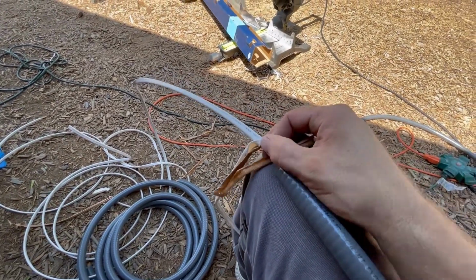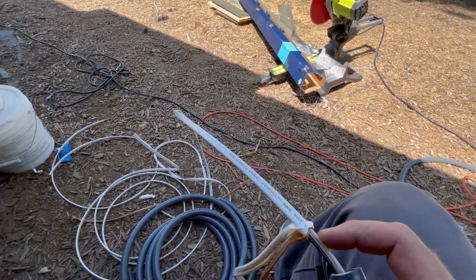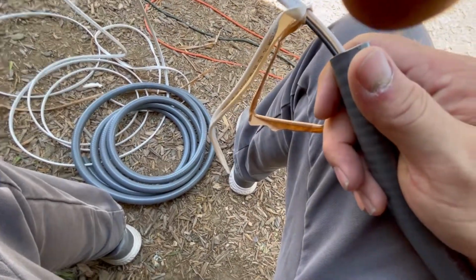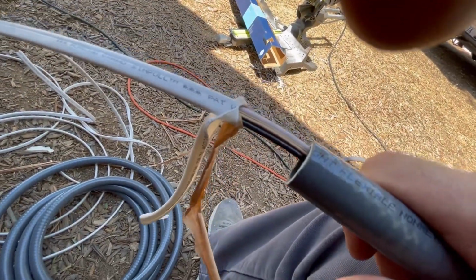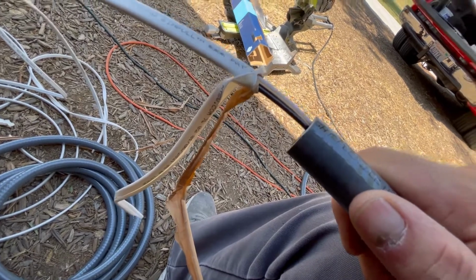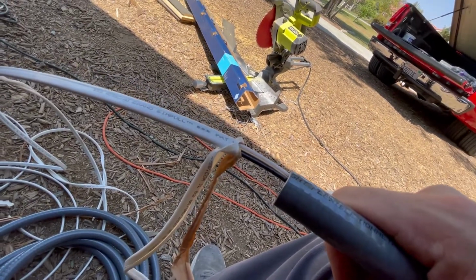This is going to help deal with the heat. There's also a chart, I'll post it here, based on the gauge of wire and the size of the conduit, for how many wires you can run in here. That's not so that Joe Bob doesn't smush another run of wire in and find it too hard. That chart is to code because of the ability of the wires in that grouping, in this size conduit, to dissipate that heat. Stay safe, do things the right way, follow codes, and you'll have a good time.